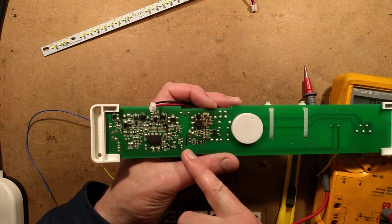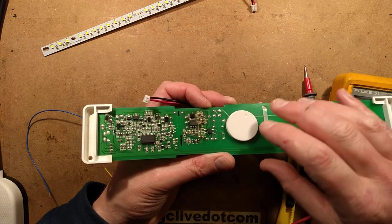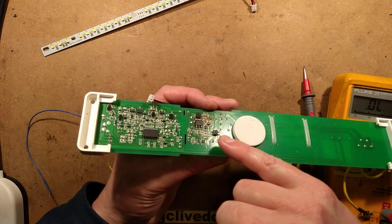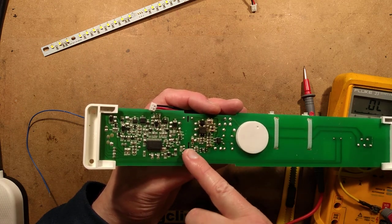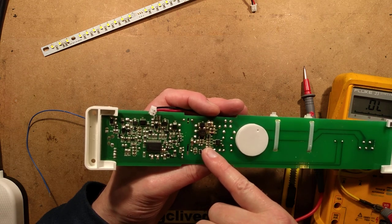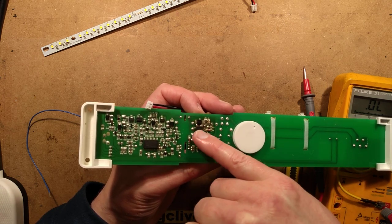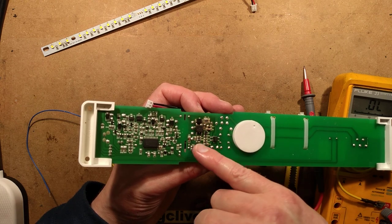I'm guessing that is basically a switch-mode chip. There are little transistors and it's quite packed. That's part of the feedback because there's an opto-isolator coming from that side, which then seems to be controlling the input. That big diode there is probably part of the snubber network to take off the switching transients at the input.